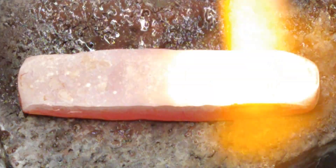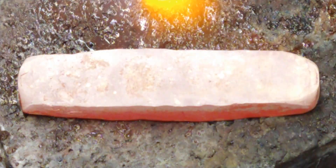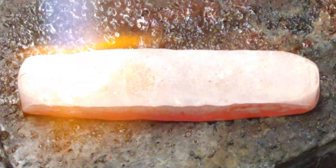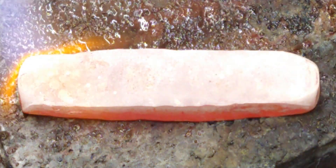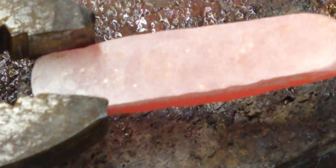See how it's just glowing every time I pass over it? This is just right before critical time. If I linger even a second too long in any direction, this piece will become liquid. It's been there about 20 seconds. I got my tail chasing the flame. And now it's all black and white.